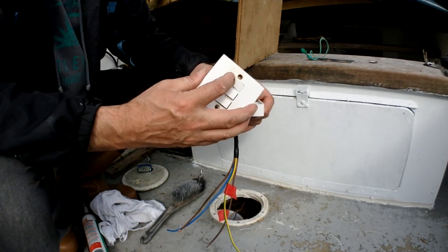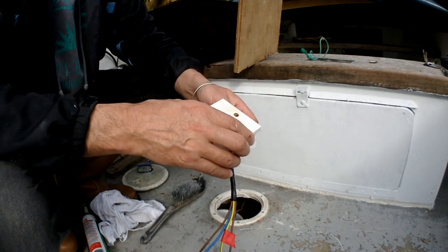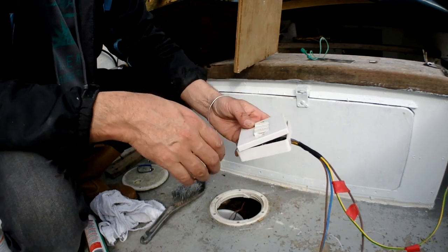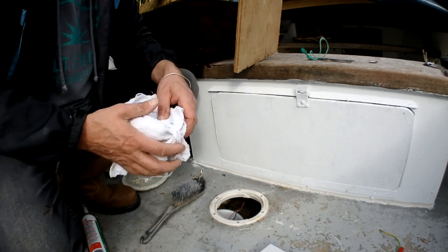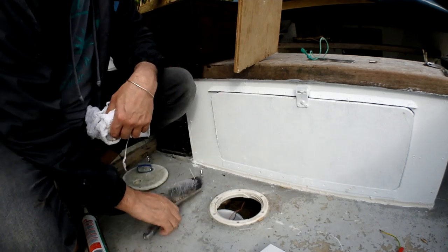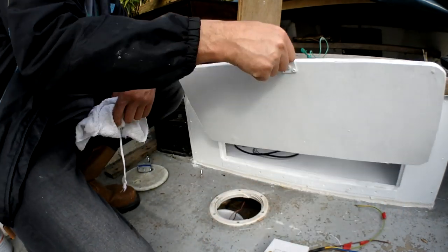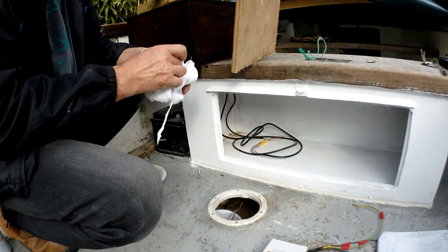You could have one switch for the light — I'll have a separate switch for the boat light — one for the GPS, one for the fish finder, one for the pump, that kind of thing. It's all greased at the terminals and closed up, goes up under the seat so no water can get at it. When your hand goes under, even if it's wet or damp, any moisture on the switches won't siphon back. This has been on the boat for two years and it's still perfectly fine.